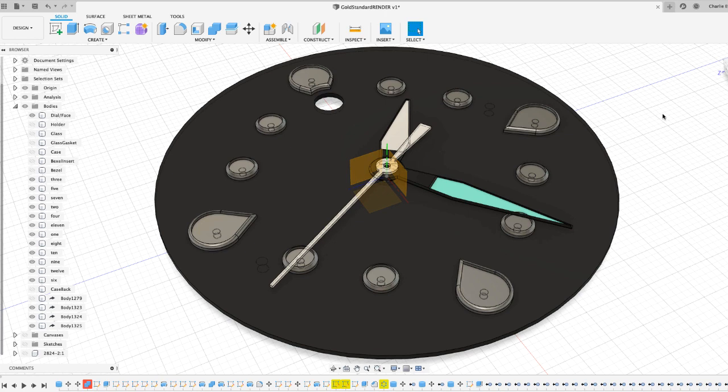The way we get this hand to be green, so it matches the watch's theme, for want of a better word, is to add a dye to the lume compound. And it's the kind of dye that you use to colour resin. So it has an index of refraction, so it's kind of see-through. So it doesn't kill the lume's brightness, but it will colour the clear areas of the compound. There's a slight loss in brightness. Not measured it, but I would estimate somewhere between maybe 10 and 15%. So the minute hand will be slightly less bright.